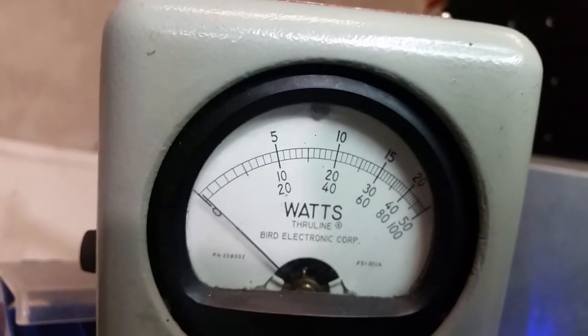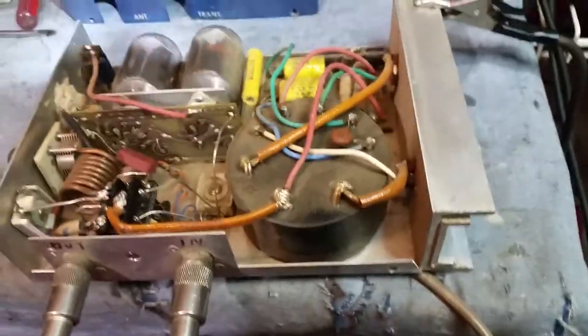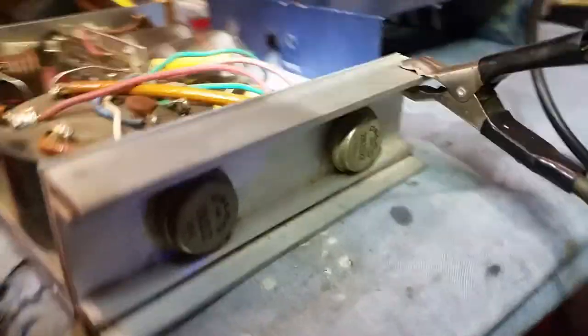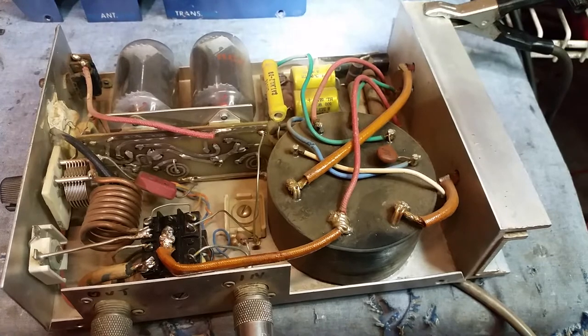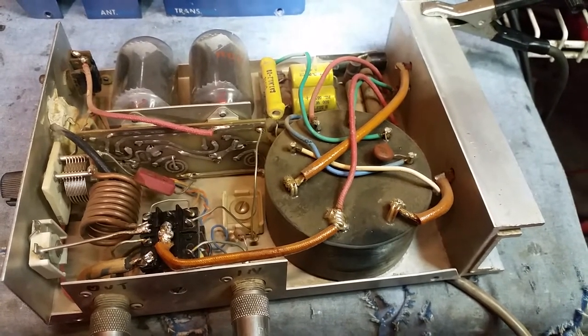As long as you're okay with the old hissing sound that the mobiles make — all these mobile amps make that sound because there's just no way around pulsating that DC to make the transformer work. That's what those two transistors right there are doing, because these tubes run off multi-hundreds of volts, so you have to pulsate that DC voltage.